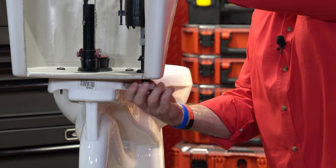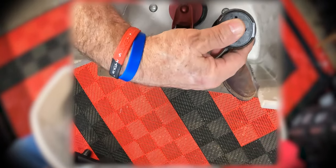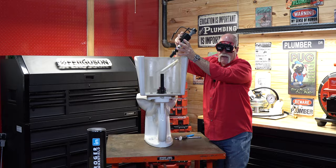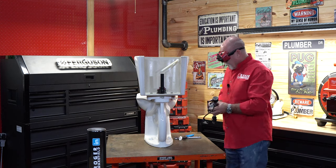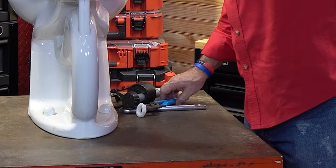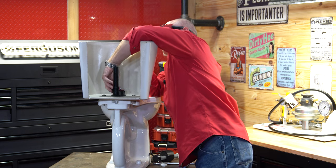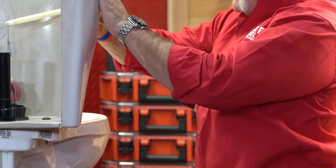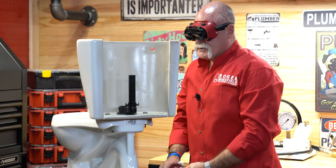I have already got all the water out of it. If I've got all the water out, I really don't have to worry about it. If I still have some in there, make sure that I've got a towel there so that when I pull it up, this washer — I'm reaching in through the back — all this is going to be done from above. But that washer, once you break the seal on that, any water left in the tank on this side is going to come out. So I've got this part off — step number one. Now I'm going to go ahead and take off the handle. Looking at everything upside down is really nuts. I would reach down in here and undo. I am keeping my eyes open. I can come in here, disconnect my flapper from my handle, and both these parts are out also.